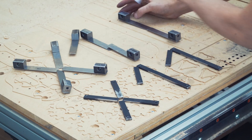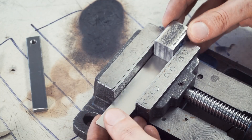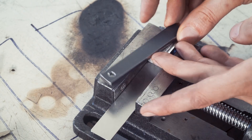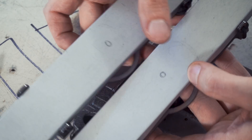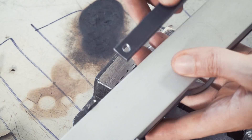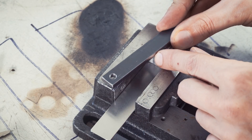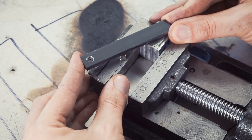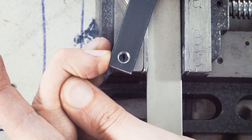I'm going to weld together 11 of these with 11 of these, and to do that consistently, I'm aligning this edge to the back edge of the vice. I want to mount this at an angle determined by the distance between the vibraphone bars, which is 55mm center to center. I want this little hole to end up exactly between the bars — from the center, we swivel out half of 55mm, until the line goes straight through the opening.